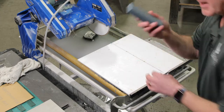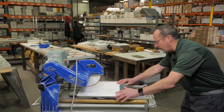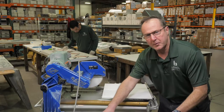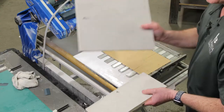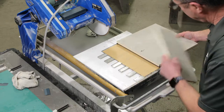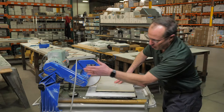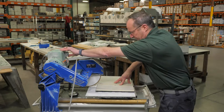I'm going to take a pumice stone and make sure that my saw blade is clean and ready to go. So I'm going to put a piece of tile in the wet saw. We've got our template made — I made another template because I want to span both sides of my cut. I'm going to use the longer template on this side and the shorter one on this end of the glass, because I actually have an arm on this saw and I've got to make sure that it clears, but it still protects the entire part of the glass tile — the paper.